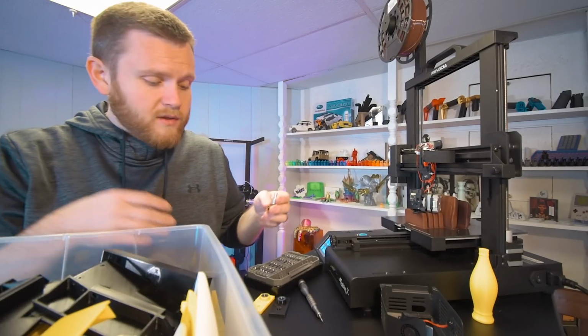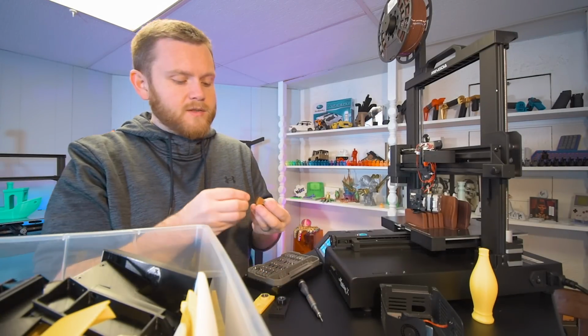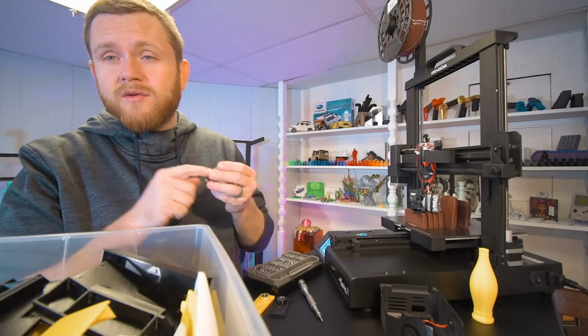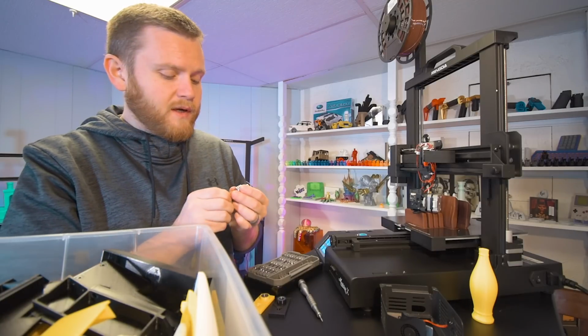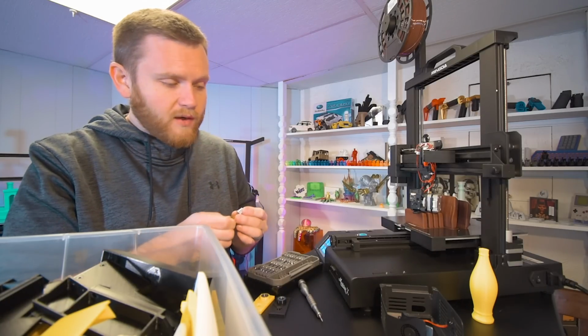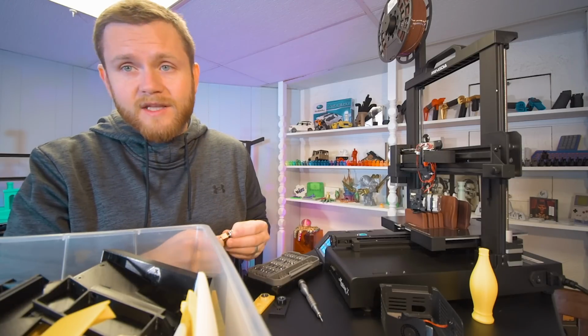So the PTFE tube actually touches the nozzle, which was my original concern. So I wouldn't necessarily recommend going really high in temperature. Stick to PLA until you can get at least a Capricorn in there. If you can get a hold of Tech Boss, my favorite PTFE tubing, that would be even better, but I haven't been able to find them in months.